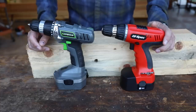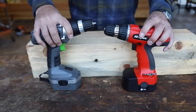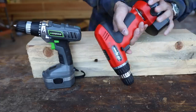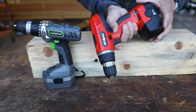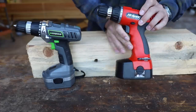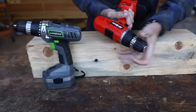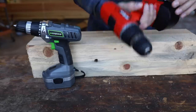We're going to do a series of three tests. First, we'll do a drilling test, put them to their paces, then a drop test, and then we'll go head-to-head and run them until one of them dies. So let's do a quick overview. We have an 18-volt, kind of old-school technology battery. Everything feels — well, not great. A lot of burrs, not very good fit and finish, not great ergonomics, but not bad actually. This feels better than some of the lower-end Ryobis I've picked up before. Forward reverse, it's got a clutch — does the clutch work? Yeah, clutch works. Doesn't sound great. If we go up to the top, it only goes to 9. It's pretty torquey. Just a standard plastic chuck, no frills.